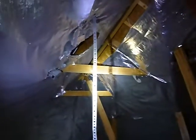Okay, we can tell that's OSB decking. And we've got attic power vents. They cut holes in the radiant panel, which compromise that, and they added 2 power attic exhaust vents. Those are out of favor. Those vents will pull. Your soffit vents are all clogged up. Where's it going to get all the air? All this conditioned air is going to come out of here and go up through those power vents. Just saying.